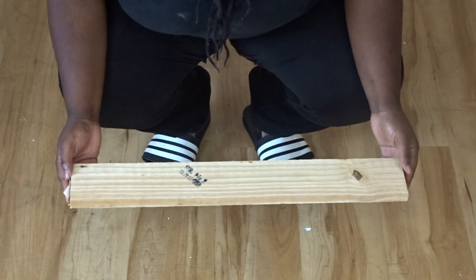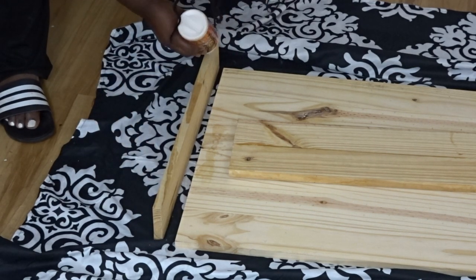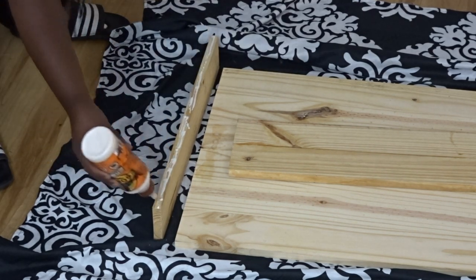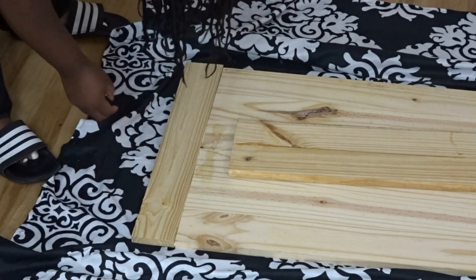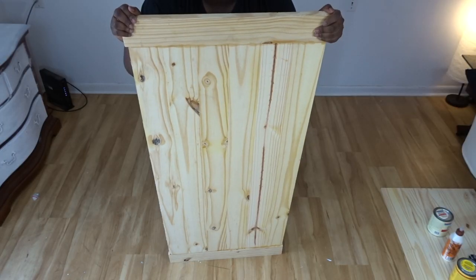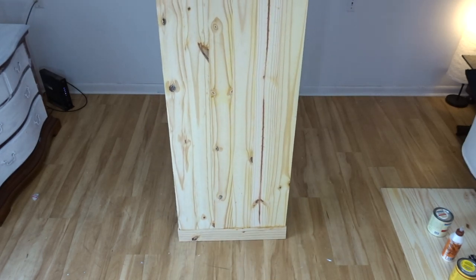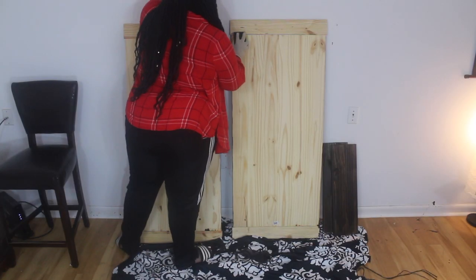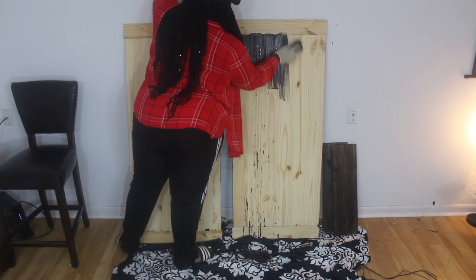So this is how the 24-inch boards look. I know you're wondering why I didn't just get that extra length cut, but I wanted my grains to be going a different way. So right now I'm going to take that Gorilla Wood Glue and attach those 24-inch pieces onto those 24x48-inch wood pieces. Once attached, I let those sit overnight, and this is how it looks. I like the way the grain goes a different way. I also attach two pieces to each other to use as levels for the clothing rack.